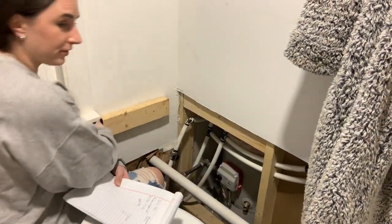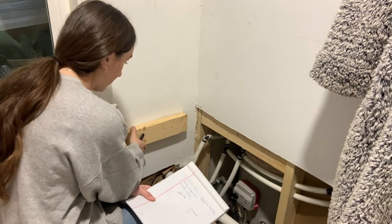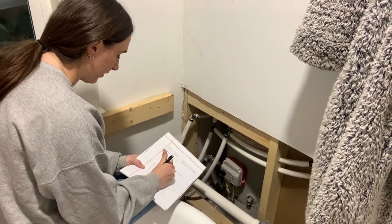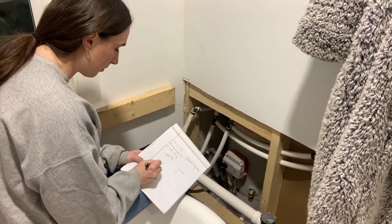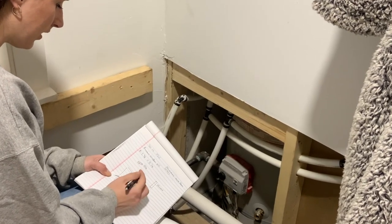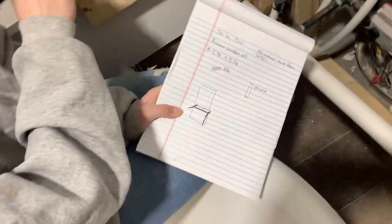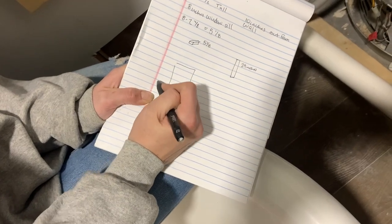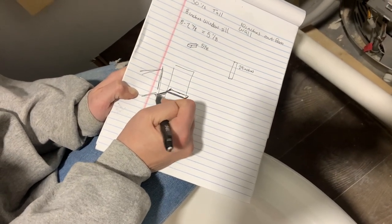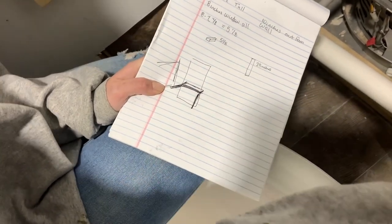So we have this corner and we are going to build a shelf that sits here and also goes across like that. Just a little 8-inch shelf just to cover all this ugliness. So we just put this 2x4 on the wall. This 2x4 is screwed into some studs, so it's very supportive. Now we're going to put a bracing across. So here's the wall, okay, and we're going to put the bracing here, and here's the brace that we just put in, and we're going to put a leg down here so that we can put the shelf right across here. And the shelf will be its own, like, little thin board, okay? This is the window here. This is the window. This is the 2x4 we just put in right there. So we're going to put a 2x4 in here, we're going to put a 2x4 in here, and we're going to attach it to the wall.